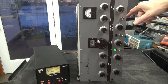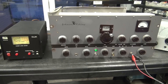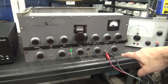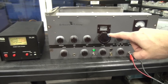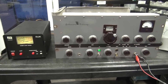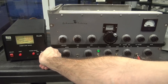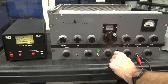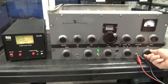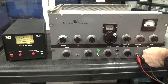I'm going to flip this thing down and inject some audio into the mic jack to see if this thing will actually modulate. I've got the Viking 1 sitting the way it should. For audio input I'm using my Leader audio generator — just going to pump in about a 500 Hz tone. I want to see if the meter moves and if we see more wattage output. It'll idle at about 100 watts and you should see that forward modulate. There's our 100 watts — oh yeah! You can hear that tone coming out of the transformers. It's working!